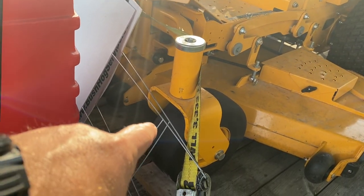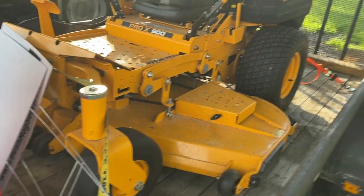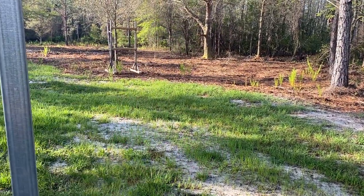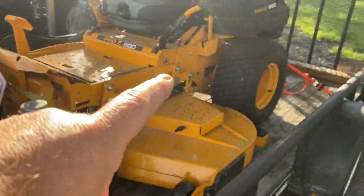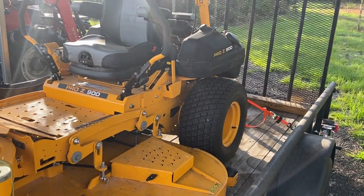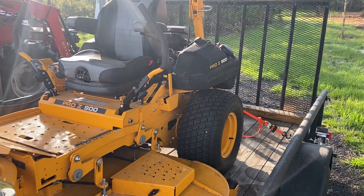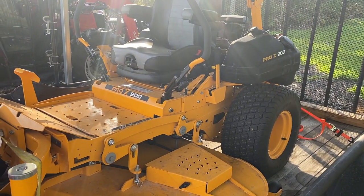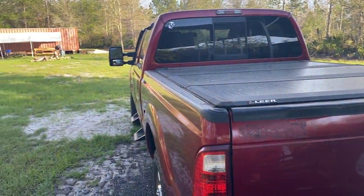The other thing is solid tires. The other mower we rented to get started kept getting flat tires in the front. Out here in these areas, anytime you have a fire, the little stubs that are left all turn into tire puncture hazards. So having solid tires up front is great. On the back, I'm going to drain the air and put a Kevlar fiber product in there, so even if the tire gets a flat or a small hole, the Kevlar fibers blow into the hole and keep it from deflating. Really great product. Alright, time to load up and get out of here and get this job done.